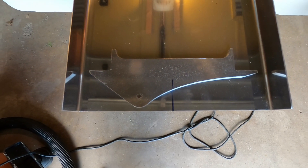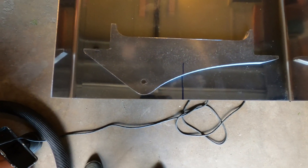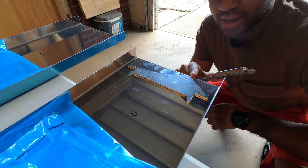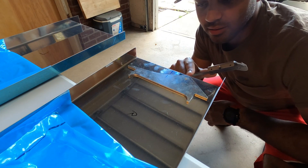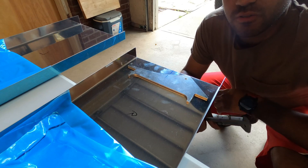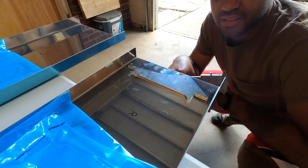I'll measure them up — a little off. I'm going to mark out where these are, take some final measurements, going to center punch where that hole should be drilled, mirror it on this side, and drill our first hole. Scary stuff. The instructions call for about a half inch of remaining material. I have a couple inches to spare on the overall length, so I'm going to follow the instructions: measure a half inch from this edge, mark it, center punch it, and start drilling.